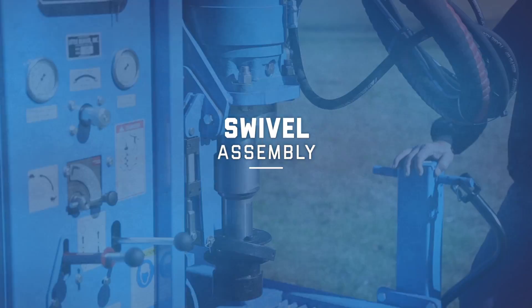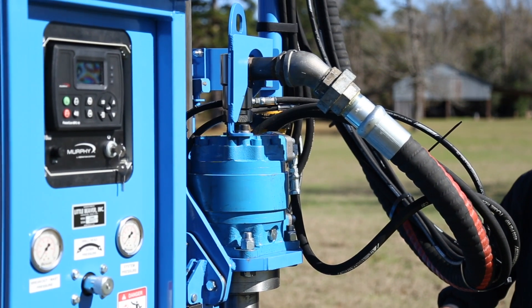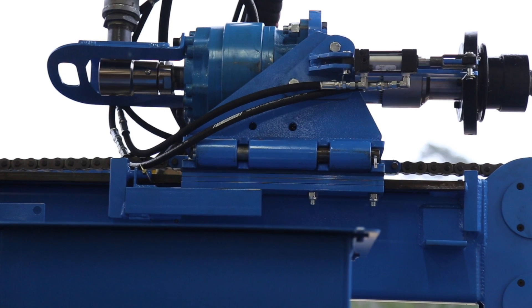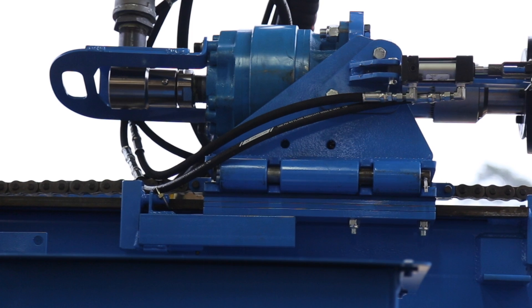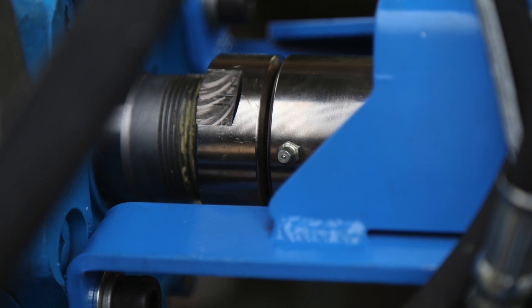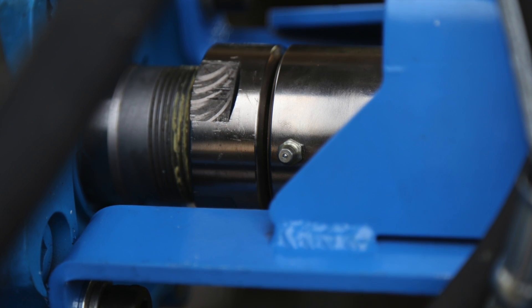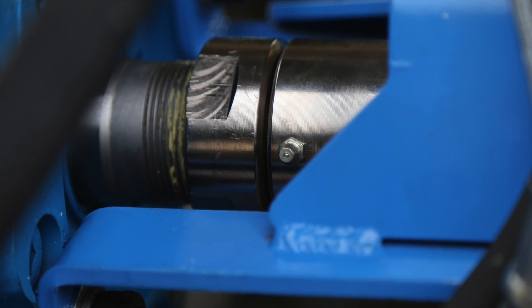This rotary is equipped with a high torque vane motor with a super duty water air swivel attached at the top. The swivel can be quickly and easily serviced or replaced when necessary. Do not lubricate the swivel for the first 8 hours of running time — it's pre-loaded with grease. After the first 8 hours of run time, the swivel should be lubricated every 8 hours of operation. To avoid unseating seals, do not over grease or over pressurize the swivel. Apply no more than one half pump of grease.